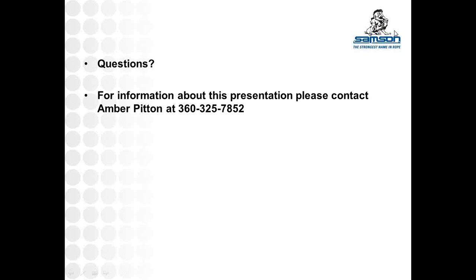Another question: will you be able to follow this up with some printed material or collateral? We do have this as a technical bulletin, available on our website already. The only other item from this webinar we'd make available is a recorded version, which I'll post in the next couple of days. We also have a question: have you developed a cleaning process for the impregnated rope? In our splicing section online, there's a guide for splicing a used rope, and the first part covers cleaning — you take soapy water and birdcage the rope to remove the particulate matter. We found this works really well, especially when trying to re-splice a broken rope.